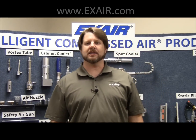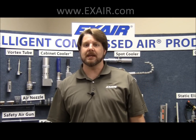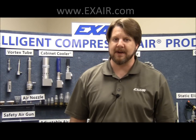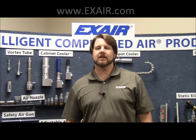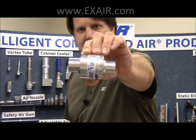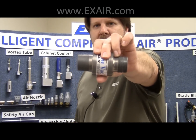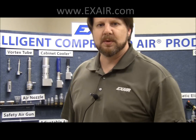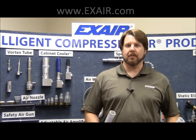LineVac is a product used to move dry bulk materials from point A to point B. We manufacture a standard LineVac and also a heavy duty LineVac. We manufacture these in aluminum, stainless steel, and 316 stainless steel, with both smooth end connections and threaded end connections. NPT threads on these from 3/4 NPT up through 2 inch NPT, so that they can be used with both hose and tube or pipes.